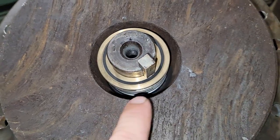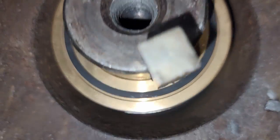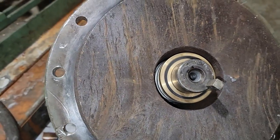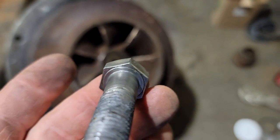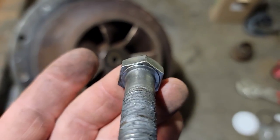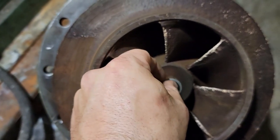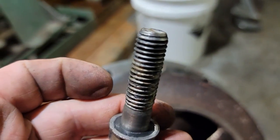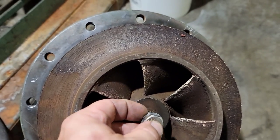The final seal is going to be this washer that has rubber in between it, going on top of this propeller like that. That's the old seal right there. Before we get too far, we got to look at the set key that goes on here — that set key just barely misses that rubber. That's got to match up with the propeller, and we've got to make sure that slides right into the set key slot. I went ahead and ran the wire brush wheel on that flat surface there.